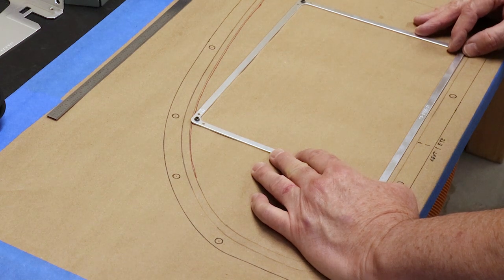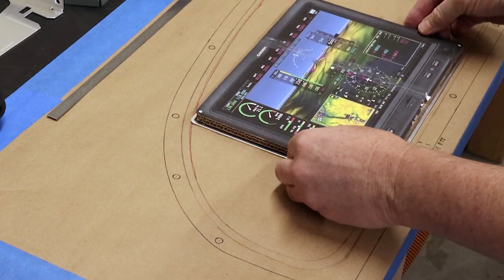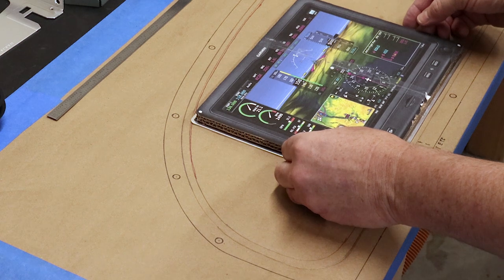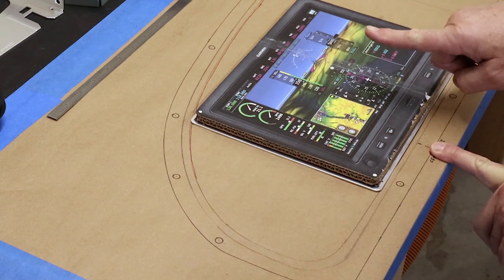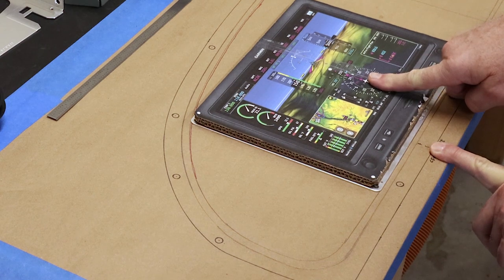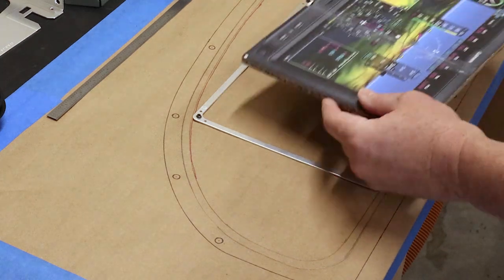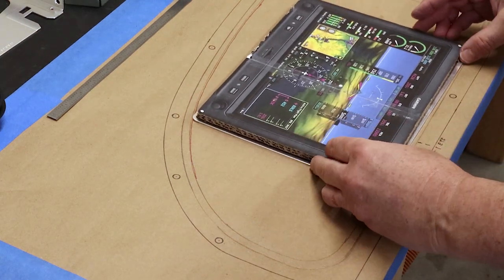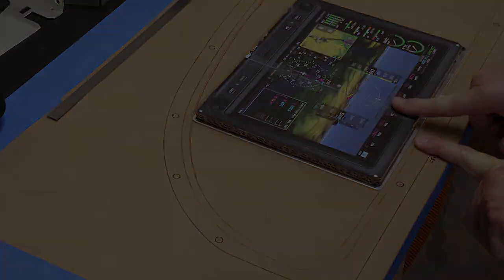As an industry standard, the engine gauges must be on the side of the display closest to the engine controls. This print from Garmin is for a tandem seat airplane or right side with the engine controls to the left of the co-pilot. Fortunately, the G3X allows configuring the engine gauges on the right of the display. So it will really be like this, which allows a centered attitude depiction to the design eye reference point.